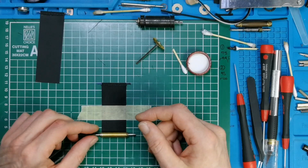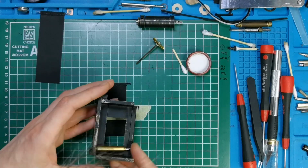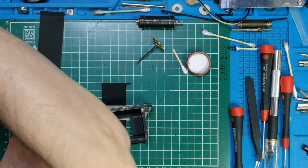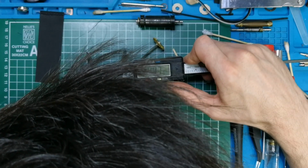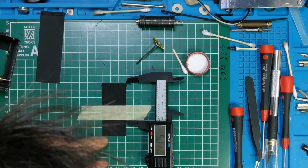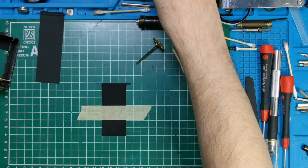So instead of going a full turn, I will only have to, actually I can calculate this, because the roller sits in this hole like this, and the edge of the curtain is somewhere around here. So let's see how much we have. Like 48, let's say 50 millimeters. So 50 millimeters is the free part of the curtain, and that means the rest can be glued to the roller. I will use less than that because it seems weird.